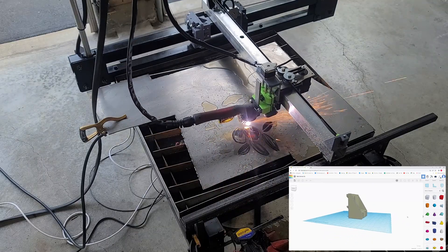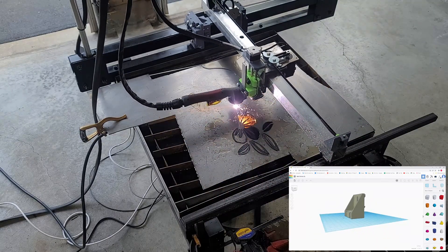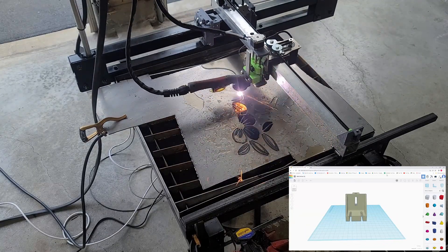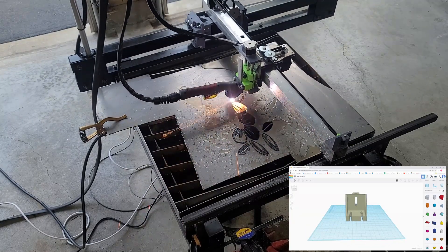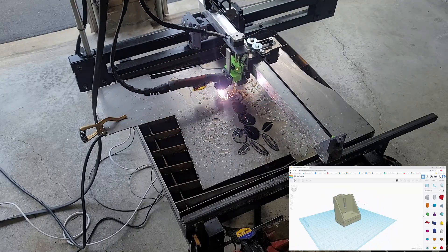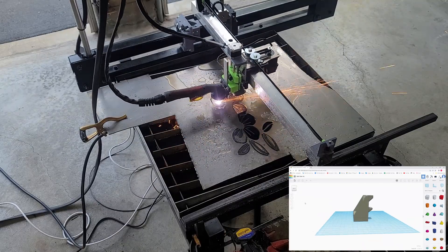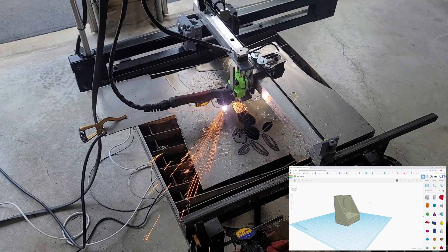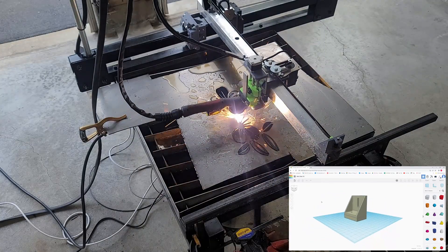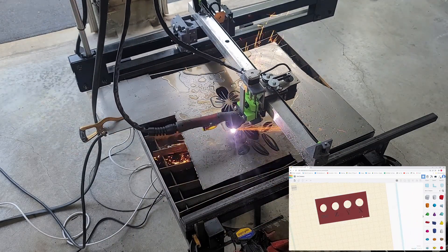A couple of the changes I made: one was with the active belt mount and the other with the idler belt mount — I made them larger because on the y-axis it had to stand off more for the belt to ride smoothly. I used GX16 4-pin aviation connectors for all the connections going to the electronics and also to connect to the plasma cutter.